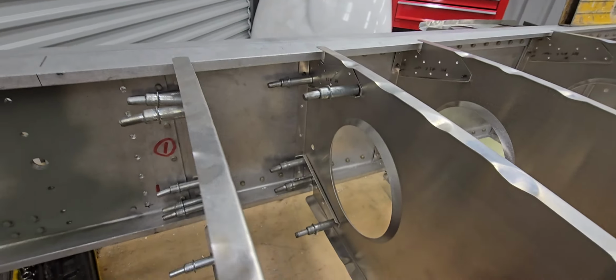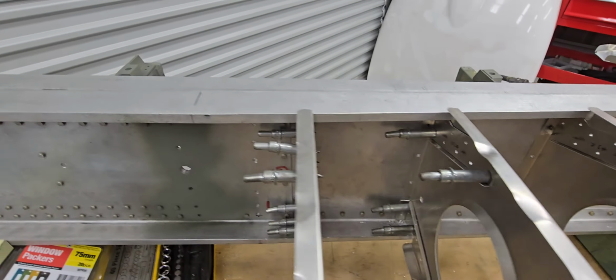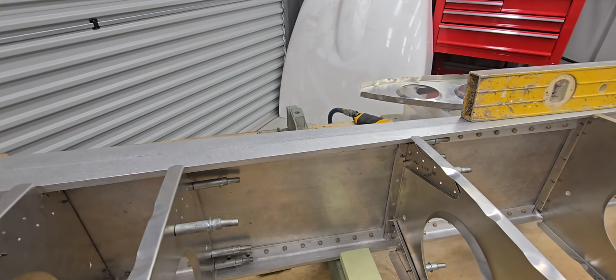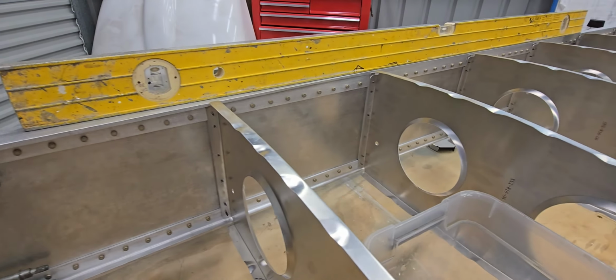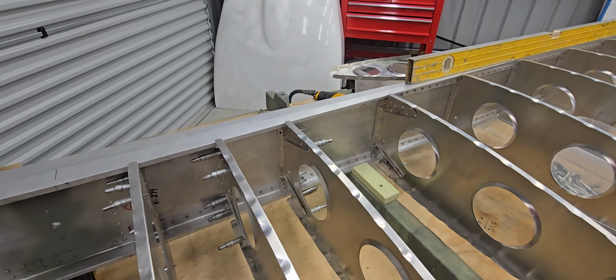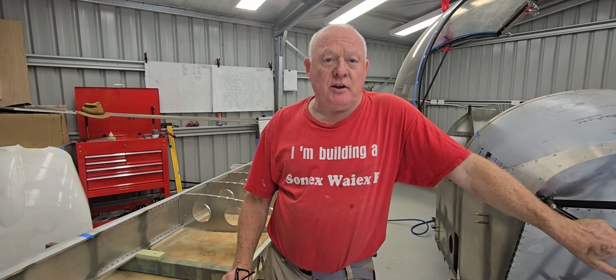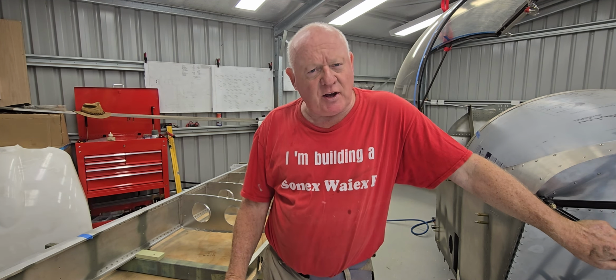just leaving the rivets down through the actual spar itself. So you can see it's quite tight in here for the first at least 3. Here's your root rib here, and then by the time you get to rib number 4, it starts to become easier as you work your way through. So I'll get on and start preparing these aft ribs this morning, and come back in a few hours. Talk with you soon. Ready to start riveting these nose ribs and aft ribs. So let's get the rivet gun out and start riveting.